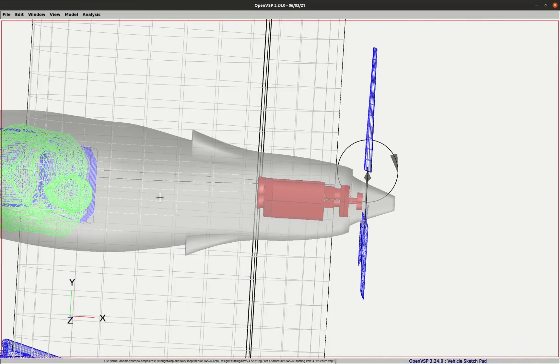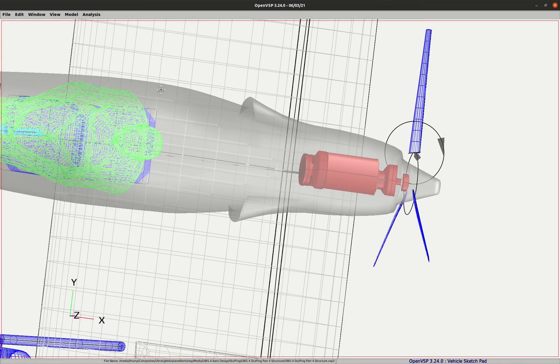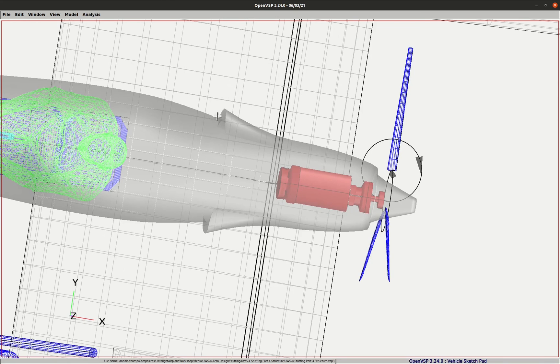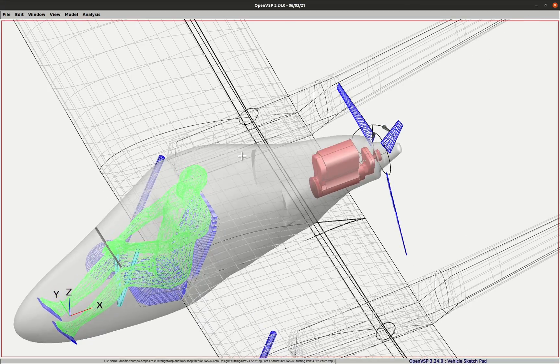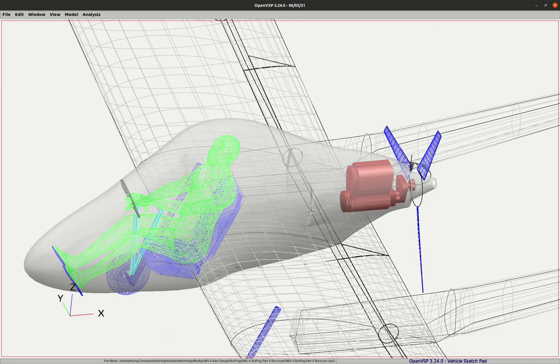Regarding positive versus negative pressure: ideally, the scoops would be placed up near the widest part of the fuselage where there's slightly more pressure to help push air in. But that would have required ducting through the firewall, adding weight. Instead, there's nice negative pressure at the aft end that should do a good job sucking the cooling air out, and having the scoops in the current position shouldn't be too problematic. The prop will also help keep air attached as it flows around the pressure recovery part of the fuselage. The compound curves on the aft fuselage would be very difficult to make with aluminum without an English wheel, so composites are the right call.